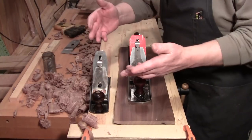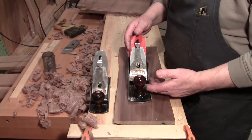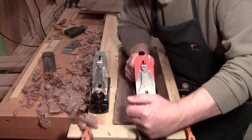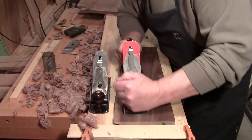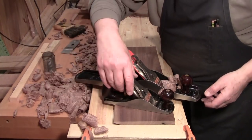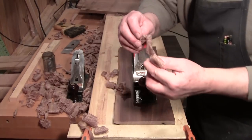Can we live with just one hand plane? I have to concede that I like the number six. The number six for me allows me to create a level surface quicker and more accurate due to the comparatively longer length of the plane. Even when I'm working on wood that's slightly shorter than the plane it helps. But I have it set up as a smoother.